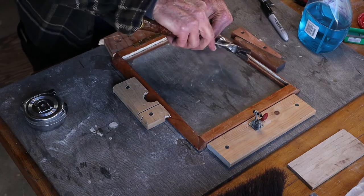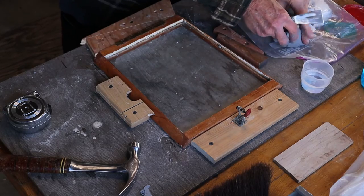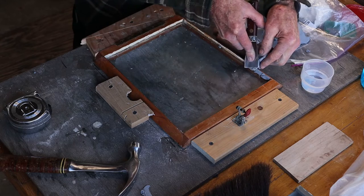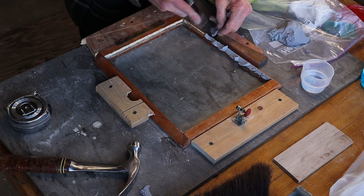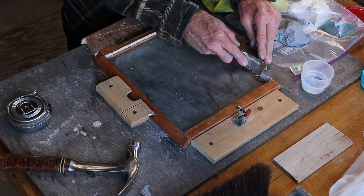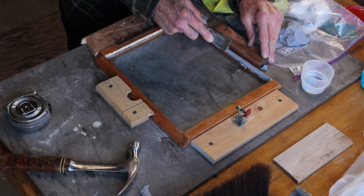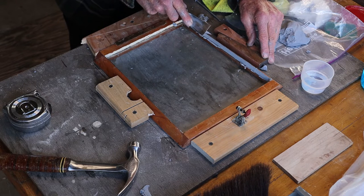I'll try not to break my glue joints. This is gray glazing putty — it sets faster than the typical white stuff. It's typically used for metal sash glazing, but there's nothing wrong with using it in wood. It's not going to be facing the weather on the exterior. It might be a little hard for wood, providing enough flexibility for an actual window sash. But for something that's going to live inside, I think this is going to work out.